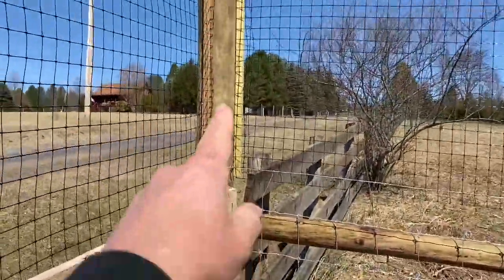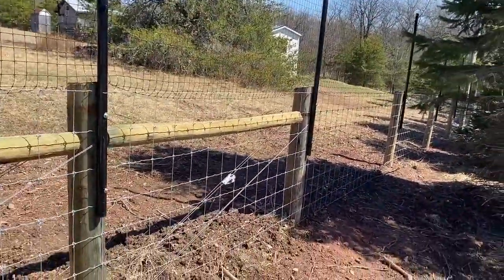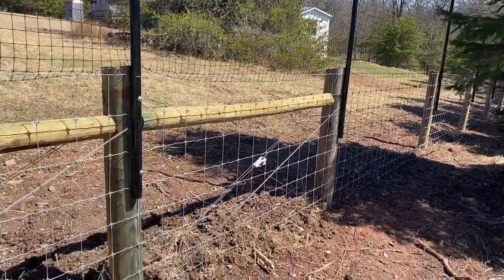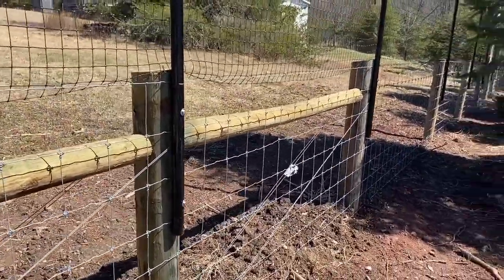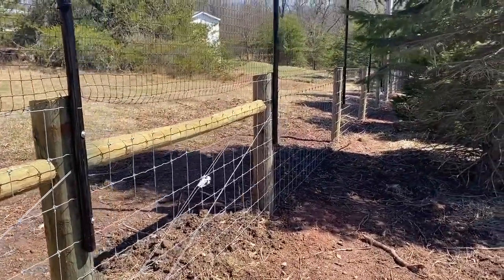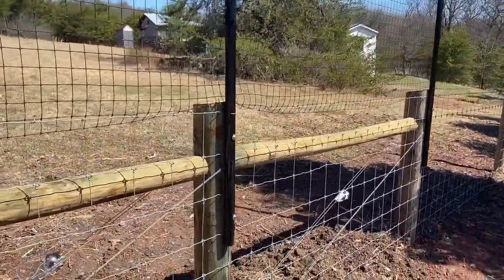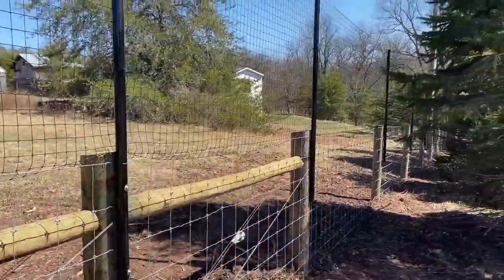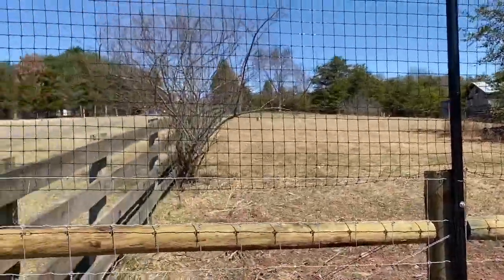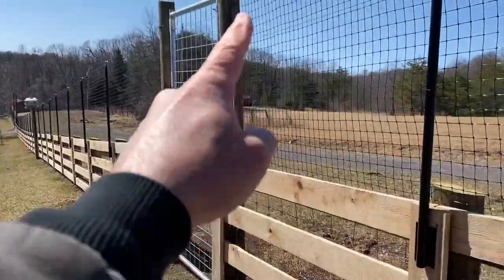This is a very light plastic, but I was afraid a deer could get spooked and jump through it. If that happens, these corner posts are strong enough to hold a field fence on top, so I could basically have eight feet of wire fence here. This was actually much cheaper than going with 12-foot poles all the way around. This also looked a lot better from the road — just having the black poles, which aren't that noticeable, versus having big pressure-treated posts sticking up.